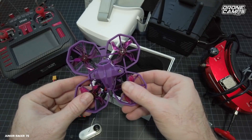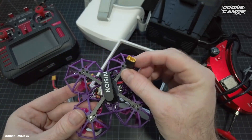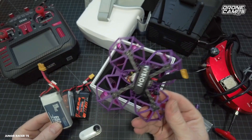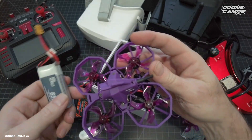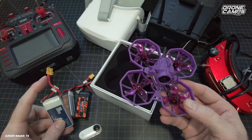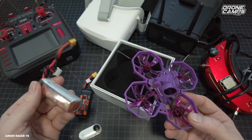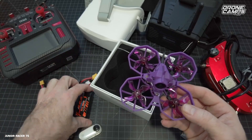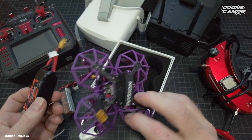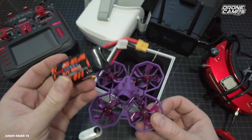This is a right-turn-rear prop configuration, 75mm. We have a dipole coming out the back and an XT30 connector. If you're looking for 2S batteries, most smaller batteries come with an XT30 — that's the standard for this size drone. If you go up to 3-inch through 7-inch FPV racing drones, you usually have an XT60. These little XT30 connectors can handle up to about 6S. We have a 3S450 here — a Kratos-style battery. I also chose an OMP Hobby 650 milliamp battery, which fits the strap and works well as a cruiser.